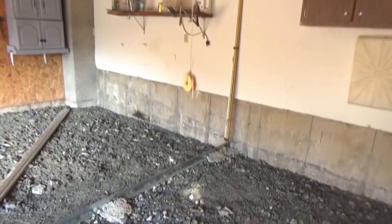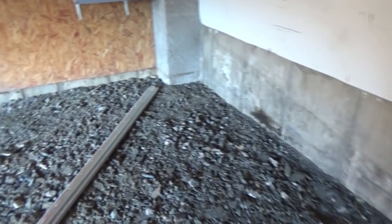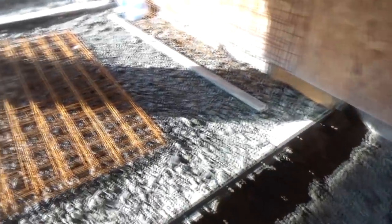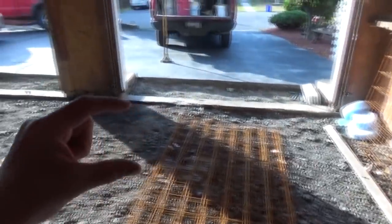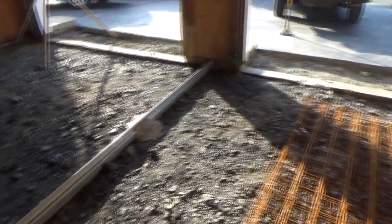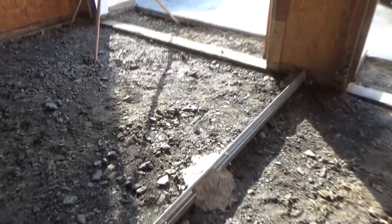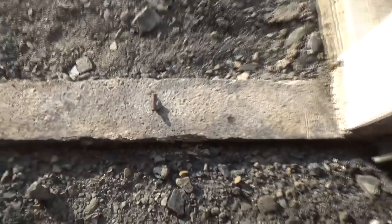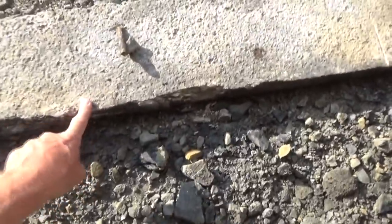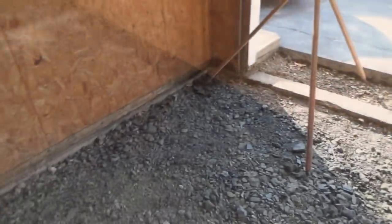First thing I'm gonna do is take my transit and check his forms. I'm gonna look around for things I don't like. The problem with this job was they only poured it three inches and it all cracked up — it looked like a stone patio. So we're gonna put the plastic down, pour six inches, and put the wire in. Here's what I don't like right now — this edge will stick in the concrete. I'm gonna fill that up first.